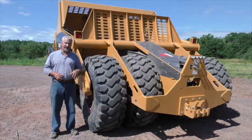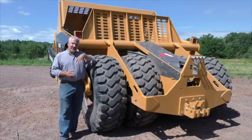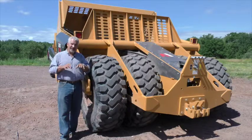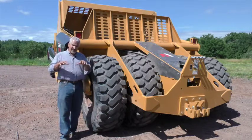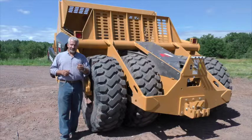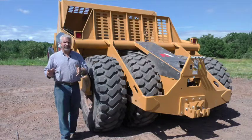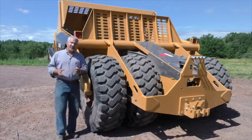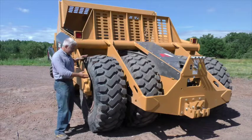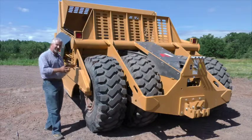At the rear of the bowl we have four 20.5 by 25, 20-ply tires — which can be upgraded to radials if you choose. There are two schools of thought on tire configuration. People who liked the Reynolds tire system enjoyed the ability to compact an area uniformly, and mounting tires in line does a better job of compaction. A lot of customers with the John Deere approach are moving the inner tires back a few inches to allow material to flow around the tire for better trash flow around the machine.